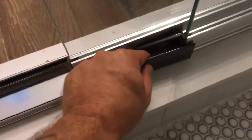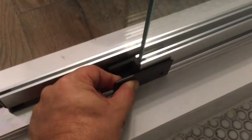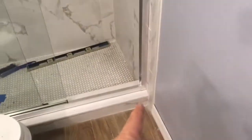The knobs just screw in. But yeah, so then at the very end, it's got a little center track piece that I haven't even screwed on yet. It just goes on right in the middle, and it has self-tapping screws for it. After you do that, run some more silicone all across the bottom, the sides, all that. On the exterior, I'm going to use a nice white caulk instead of silicone. You could probably do both. That'll also hide some of these imperfections in the cuts.